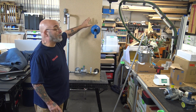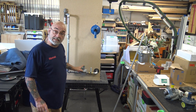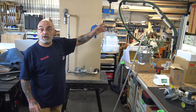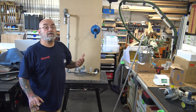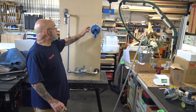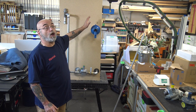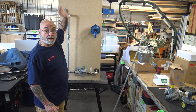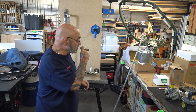Then we would maybe put, if this was a garage wall, one of these regulators inside to go from 2 pounds to inches. And then that would go to, say, the stove, the dryer, the fireplace, maybe the barbecue, and so forth. But this could be a line that has to go directly to the second tankless on the other side of the house, a generator, or a pool heater. So it'll serpentine through the rafters over to the other side.